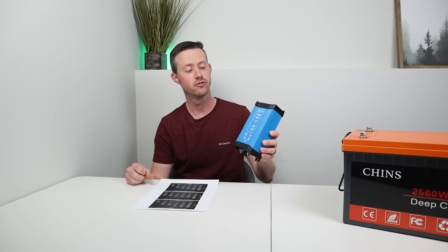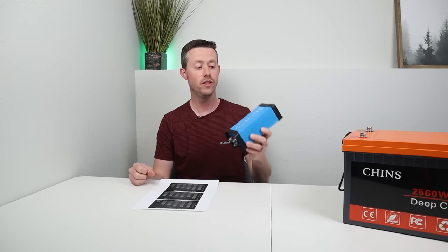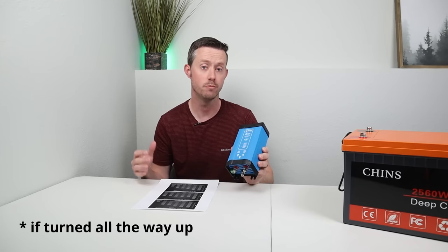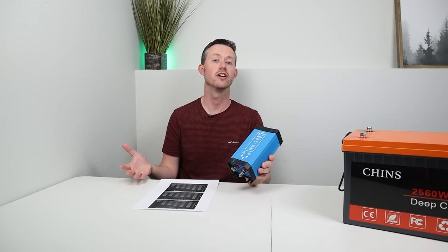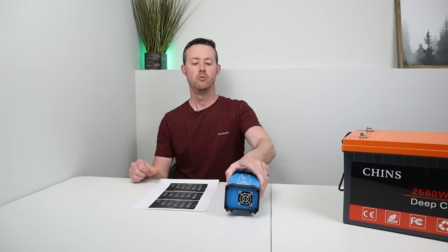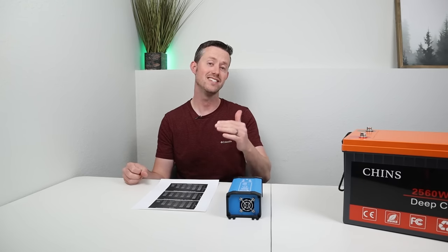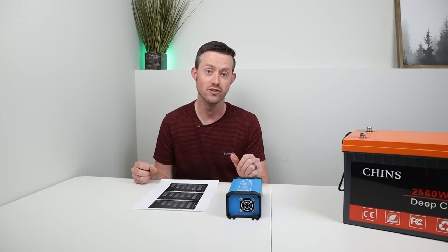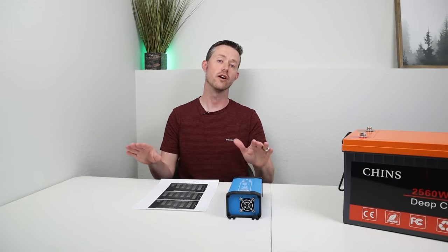Now let's break down the performance for the Victron boost converter. We saw some really high wattage on some power stations and lower on others — why is that? One key thing about this boost converter is it puts out 28 volts under peak power, meaning some power stations are going to treat this as car charging and some as solar charging. With solar charging they go to their peak amperage input, but with car charging they lower it down to 8 to 10 amps so they don't blow any fuses or burn the wires in your car. The Delta II, AC200 Max, and Delta Max all treated this as a solar panel, but the FF Power, Anker 767, and Pecron E2000 said the voltage isn't quite high enough so they charged at their lower amperage limits.